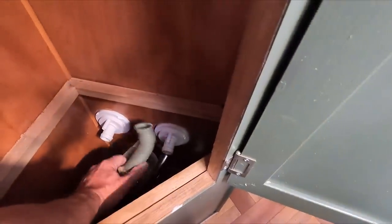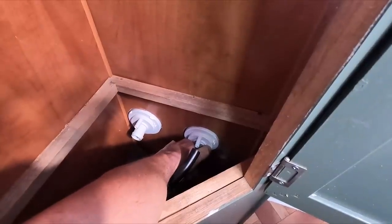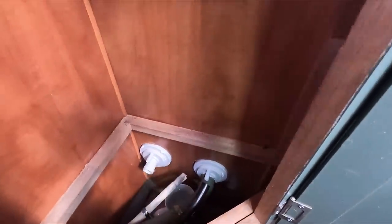The trick is boiling water - do it without burning yourself. Chuck your water in there, straight from the kettle, and hold your pipe in it. What that'll do is soften the pipe so it'll slide over really easily. And then when it cools down, it'll be nice and tight. Look at that - straight on. Just let that cool down for a sec, and repeat with the other ones.